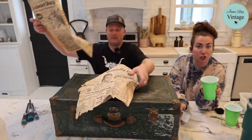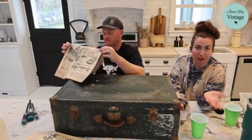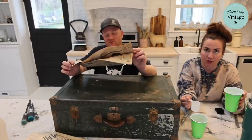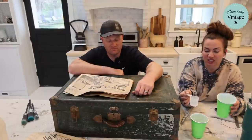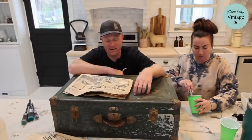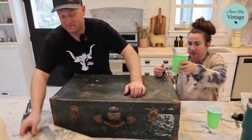We've got two scoops of Sweetie Jane — Sweetie Jane is named after Sasha, that's what her mom used to call her. We're going to do one part milk paint to one part warm water. I had two scoops of milk paint so I'm doing two scoops of warm water. I like to do just a little bit less on the water — it's like making rice, you don't want it soupy. I like my milk paint a little thicker so I decrease the water just a little bit.